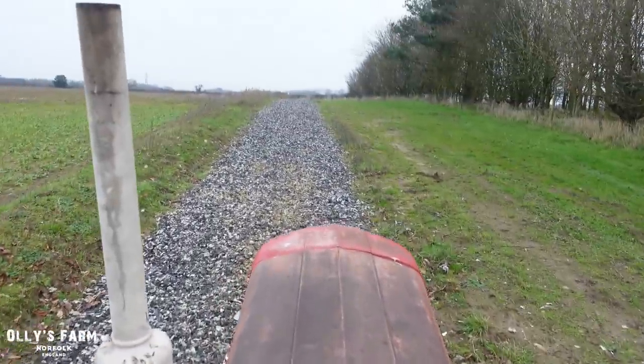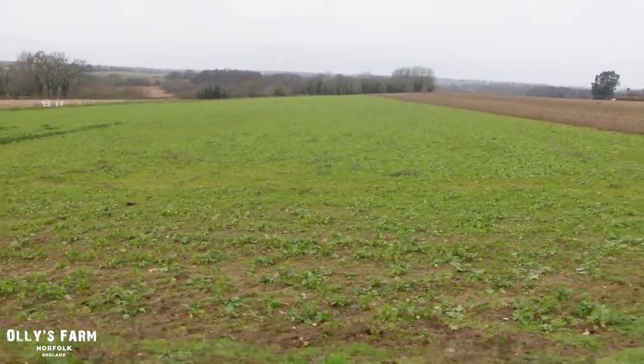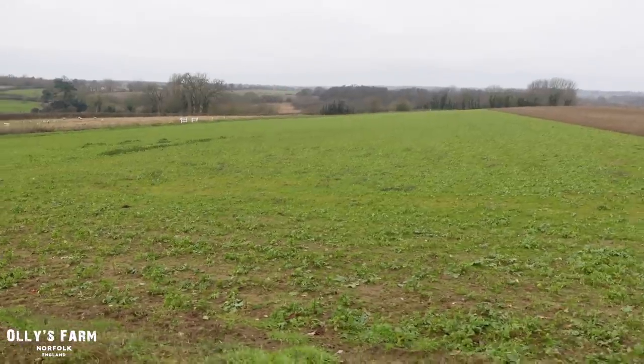So I'll go around on the right-hand side and then come back on the left-hand side. Very soon I'll be cultivating this little piece of land up here. This is in a scheme - supposed to be like a bird cover mix. I'll pull that up with a cultivator. But before we do that, tomorrow we're picking up our subsoiler. I think it's a three-leg one, and it's a Spalding's one we went for in the end. We'll go around the fields, break all the tramlines which need busting up, then do the cultivating in the springtime, and we'll probably still plough some fields which have to be ploughed to bury organic matter - like after muck spreading, for example. So we will do a little bit of ploughing and a little bit of cultivating as well.